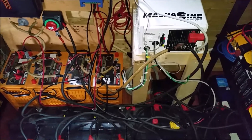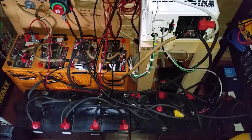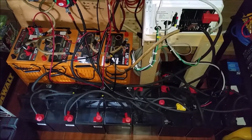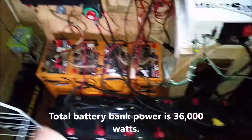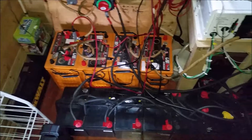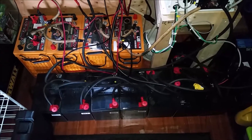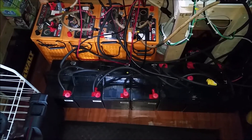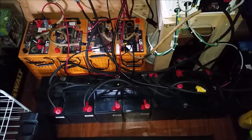This is the latest upgrade to my solar power here at my off-grid cabin. If you're going to be adding batteries to your existing battery bank, don't tie them together — they just won't work out well. So I've got two battery banks now. This is my original with the four 6-volt L16s, all tied in as a 24-volt system, and I've got 10 12-volt AGM batteries as well. They're 75 amp hour each, so that's 750 amp hour total. These ones are 780 amp hour total and I don't discharge them any lower than 50%.